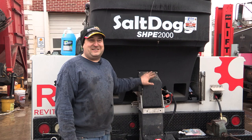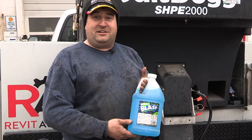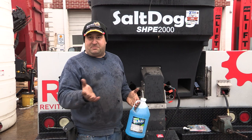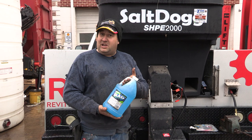The other trick: if your whole pile of salt locks up, I always tell everybody who buys one of these — get six gallons of winter wiper fluid. If your salt freezes up in the spreader, take the cover off or open the lids, dump the winter wiper fluid all over the salt, and give it about a half hour. The glycol in the fluid will actually loosen the salt up and it'll start coming out. That's something you really want to keep in mind.